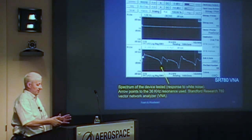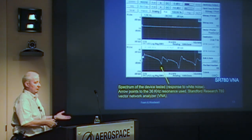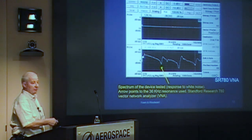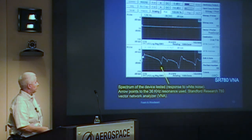The little device is sitting in its half Faraday cage, and it's got a kilohm resistor in series with it. When I plug it into this device, I believe the device itself has a 50 ohm resistance to it. So this is the kind of plot that we get when we just run the 5 volts through the device. It looks something like this. And we're thinking that this impedance dip here, this first one, is very close to the resonance of the device that we should run at. So it's not exactly on that number, but usually a little bit shifted to one side, not quite that far, but just a little bit different to that number right there. So that's how we've been guesstimating where the resonance frequency is.